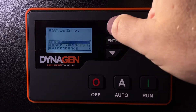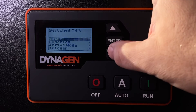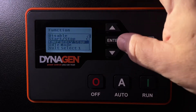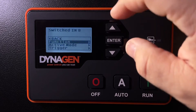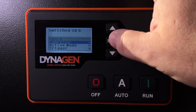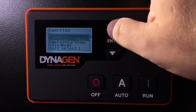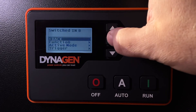The one concern is if somebody goes in and tries to change something — for example, Switch Input B — you select the function and you can't get out. There's no back option. So just note what has a check mark beside it and select that same item to exit the menu without affecting any settings. Other menus do have a back option, so that's fine. The mistake people make is going into a function they can't back out of. Look for that check mark — it could be further down or right at the top of the menu. Try not to make a change unless you know what you're doing. Find the check mark, select it again, and now you can back out.